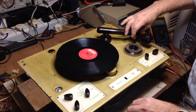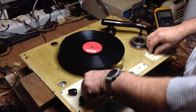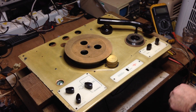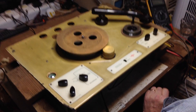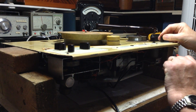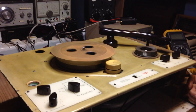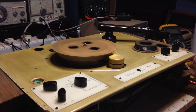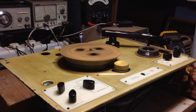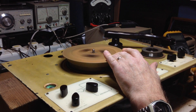I'll stop this from operating. Now I'm going to turn the motor off, and that should slow down and stop nicely. Then turn this off and switch out into neutral — I'll turn that back on to keep the valves warm. This is the tricky bit now — I'm going to get down on my knees and watch this rewind. So I'm going to switch this into reverse, turn the motor on, and it should start winding back onto the original spool. The rewind is a bit temperamental but it does pick up speed.